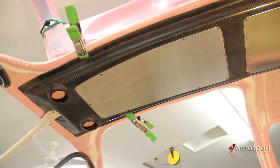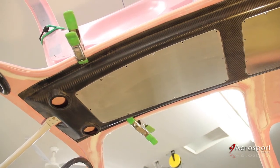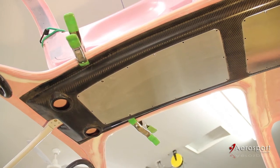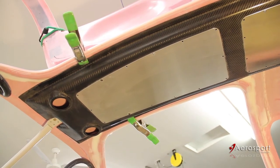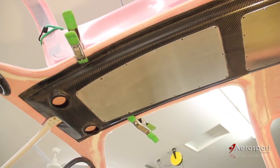Another way you could locate the front of the overhead console in the cabin top would be to wait until you finish the door openings. My doors are prepared for the McMaster seal, and in doing so you cut most of the lip of the gutter off. That gives you a good point to measure in and make sure that you're even on both sides.